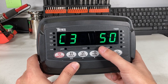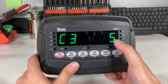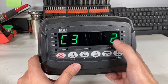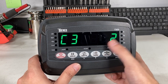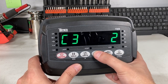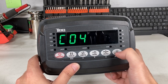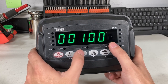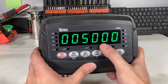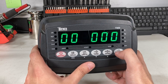If you had one decimal place previously with counting by five, that would mean half a pound accurate — counting by 0.5 pounds. With one decimal and counting by two, that's 0.2 pound accuracy. Since I put zero decimal places, counting by two would be two pounds. I want one pound accurate, so I set C3-1. C04 is the max capacity. I move right to make the 1,000 place flash and set it to five — it's a 5,000-pound floor scale — then press print.